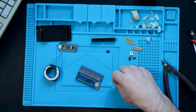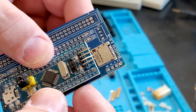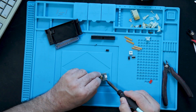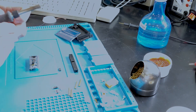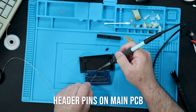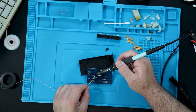Next, the header pins need to be soldered to the blue pill board. In order to ensure the pins align properly when connected to the main PCB, you can insert them into a socket or just insert them into the main PCB while soldering the first few pins. Once you tack the pins in place at each end, you can solder the remaining ones. If the first two were not well soldered while tacking, just re-solder them to ensure a good electrical and physical connection. Now that the header pins are soldered to the blue pill board, you can solder them to the main PCB, or if you prefer, solder a socket down so that the blue pill board can be removed later.